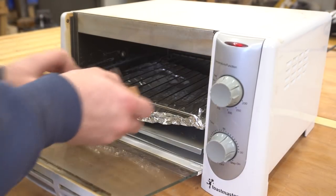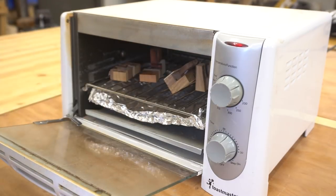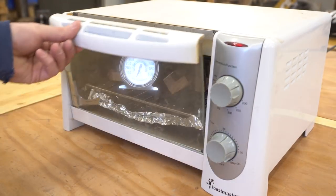The enemy of casting resin is moisture, so I put the chunks of wood in an oven for several hours to make sure that they are as dry as possible. If you try to cast these blanks with wet wood, the resin just won't stick to it.